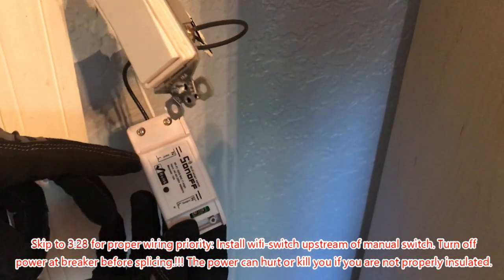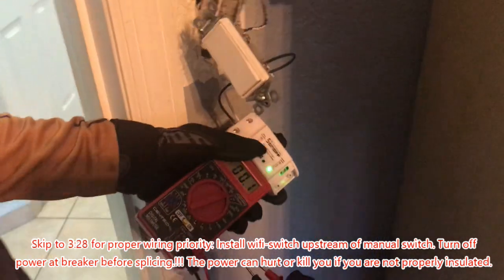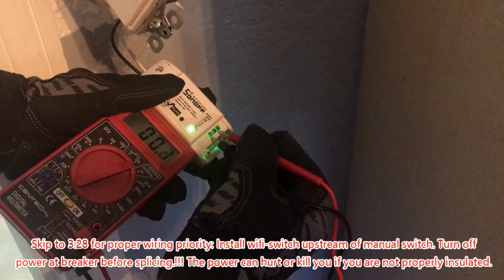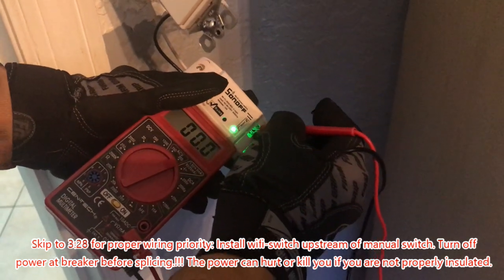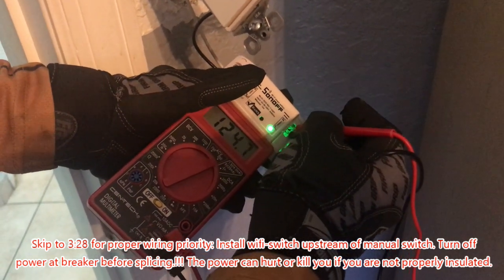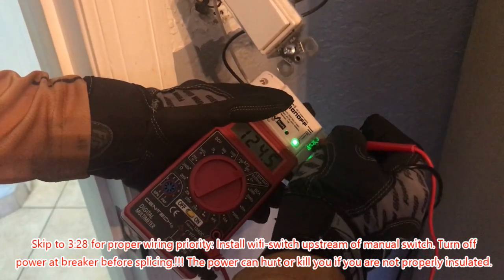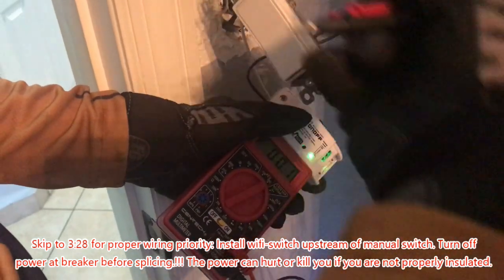What we're going to do now is connect this module to a Wi-Fi network and then see how the switching mechanism works. After you install the Wi-Fi module and test it, you install the app. We're testing to see what it's passing through on the downstream of this device. I have it set to AC 200 volts and when you turn it on, notice it passes a potential of 124 volts. So you don't need line and neutral on the output side — you could use this as a direct pass-through and just connect a line on here and it will power your lights.